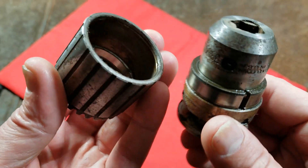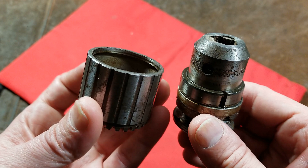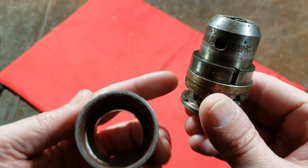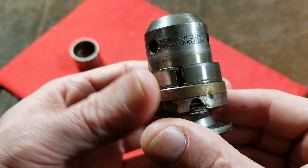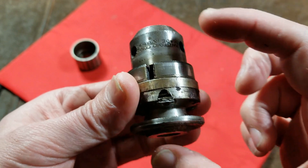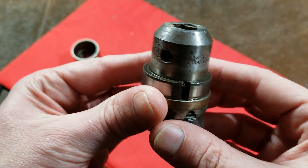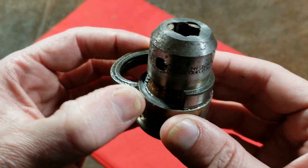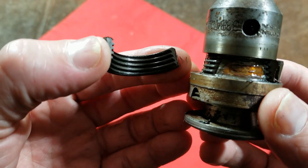You can see that undercut in the collar — that's why you need the teeth raised just a little bit so it can fit. This shiny part here is the section that presses over the half nuts. They're half nuts because the body is just one machined piece of steel with a bunch of holes and geometry. One of the reasons these were so expensive. This is a split nut, so you want to maintain the orientation, although it's pretty easy because there are tapered threads inside.